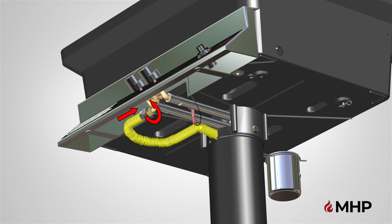Do not use Teflon tape, or pipe sealant, on any ends, because you will not obtain a leak-free seal. Keep end of fitting free of grease, oil, and thread sealant, and only use the wrench on the hex surfaces of the fittings when tightening. Once hand tightened, use an adjustable wrench to secure the stainless steel tubing to the grill valve, while using a 3/4 inch wrench to hold the valve thread.